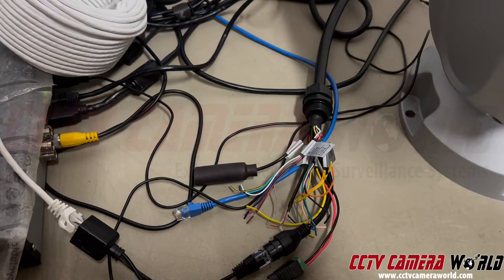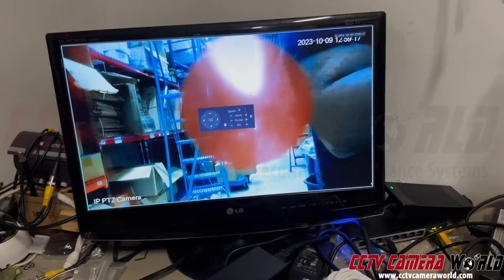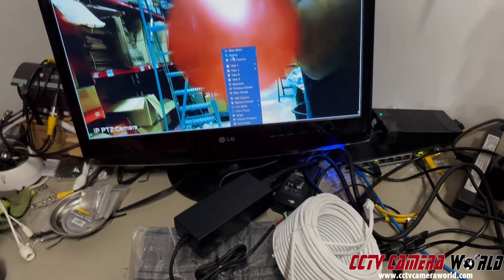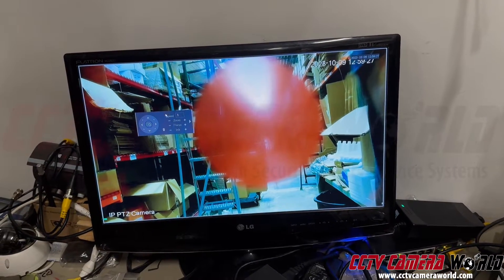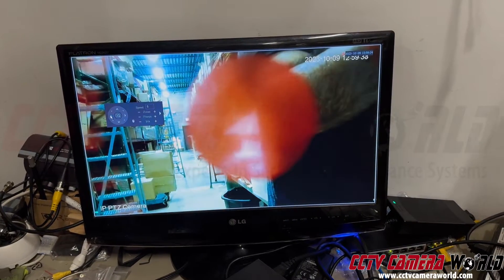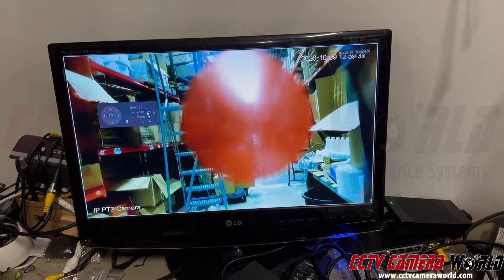This allows me to send the cable up to 50 or 100 feet away. This cable is actually about 100 feet CAT5E solid copper — you should be using CAT6, but I wanted to do this test to make this quick video to teach you and other users as well. So now I can move the camera around with no issues, and you can zoom in.